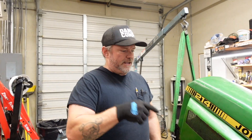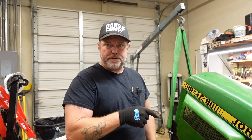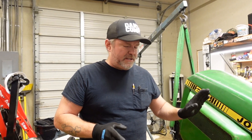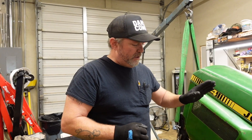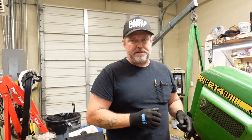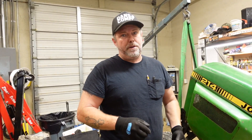It's been another day putting this thing back together. I mentioned we put a new clutch spring in the back. Here's my issue: ever since I put this thing together and started it up for the first time, the clutch pedal, when it's engaged and the belt's under tension, shudders and vibrates quite a bit. I tried to fix that by adding more and more powerful springs and even a spring on the outside of the frame pulling on the clutch pedal, thinking enough spring tension would overcome that shutter effect.